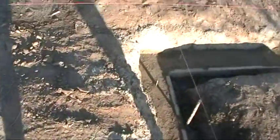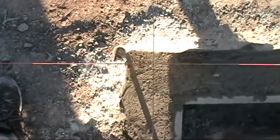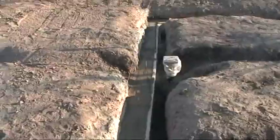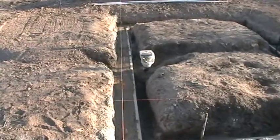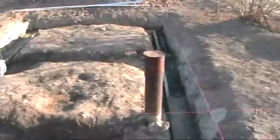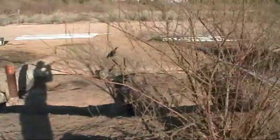These panels are fairly easy and light to use. They can be trimmed and fitted with simple tools and assembled rather quickly. Within here, this is just the footing. There will be another 2x4 set on top of this 2x6 that's been put down in here so we can set the panels in there. Then the foam within the bottom of the panels can be removed and that will be wet within the metal structure of the panel so it sits inside, locked in the concrete.